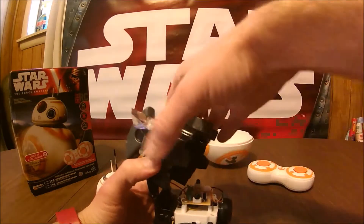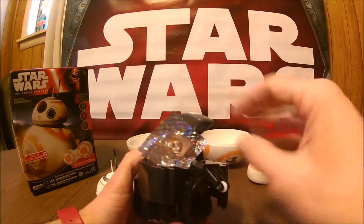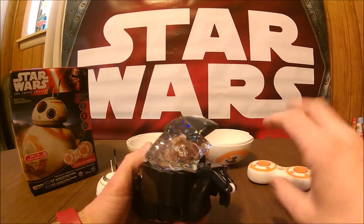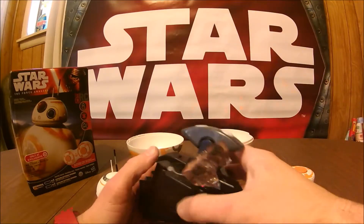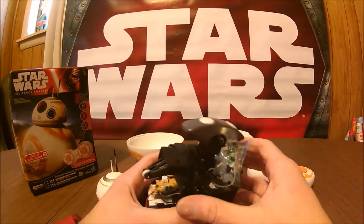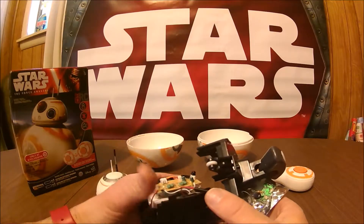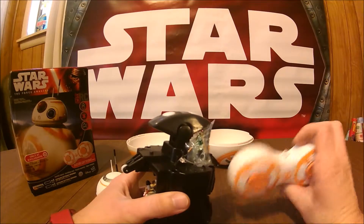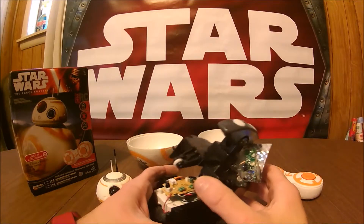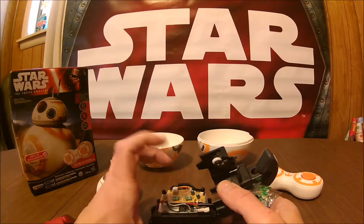And that's about it, along with the holders for the battery. What I've added here is a little LED lamp from a podium that would shine light up through a little crystal box with laser-etched characters inside. There are three LEDs here and they'll shine different lights. I had to be a little bit careful with the hot gluing because these two little bits on either side are the receivers for the infrared transmitter. I sloppy partially covered one up, but I cut away a little bit of glue and it still works.